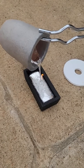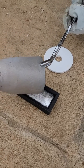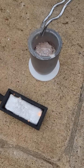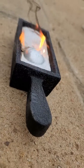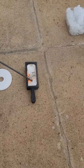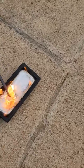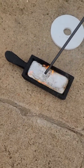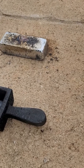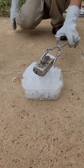The cast iron mold needs to be warmed up first. I suggest placing it right on top of the open furnace lid so it gets warm enough — this prevents little bubbles from forming, which can cause an explosion or give your ingot a weird shape. On my second cast the first one had a coating on top because it was new, which caused some flaming, but after more uses that disappears because there's nothing left to burn in the cast iron.